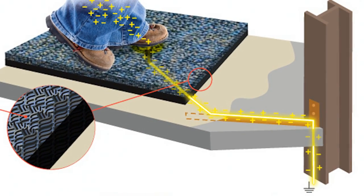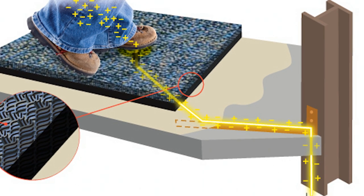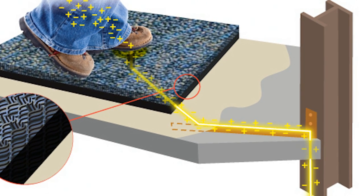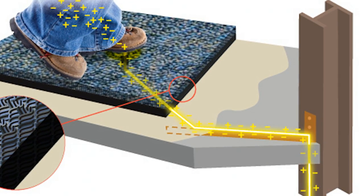Keep in mind that the shoes you're wearing in all likelihood are insulative, meaning they're not going to allow static electricity to drain from your body to the floor. So the heel strap is the bridge that allows that to happen. Another way of looking at a heel strap is that it's a portable wrist strap. The heel strap is a very important component in any ESD program, because we're not really looking at a static control floor by itself — we're looking at it as a system.